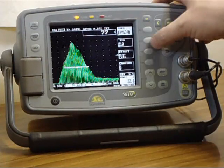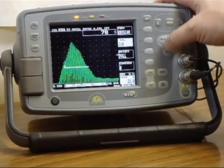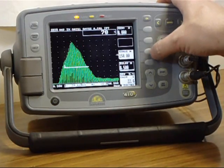Now let's look at a dynamic test with some roller probes. Firstly we switch the instrument to dry scan mode, then we optimize the filter settings, the range, and adjust again for best results.